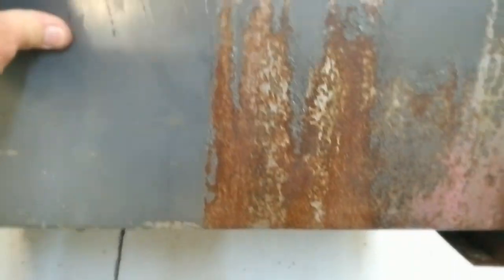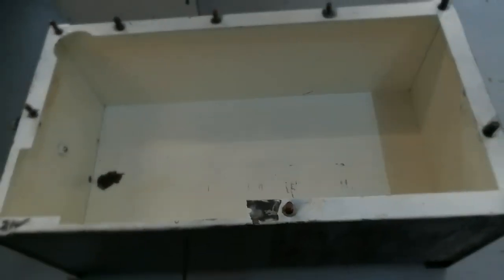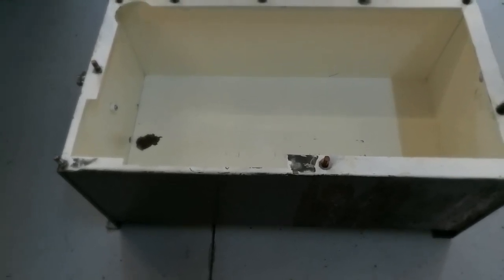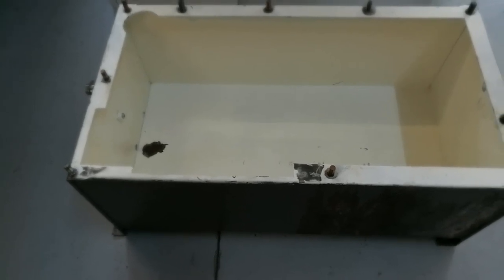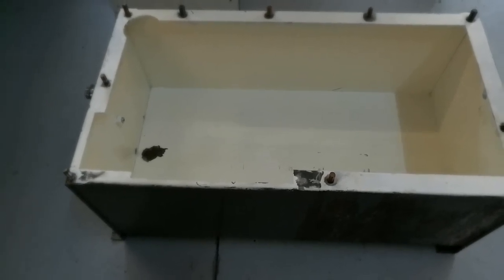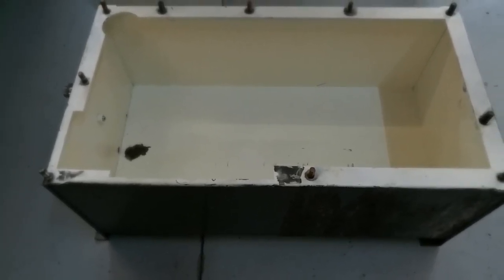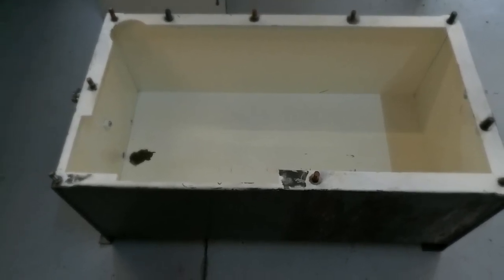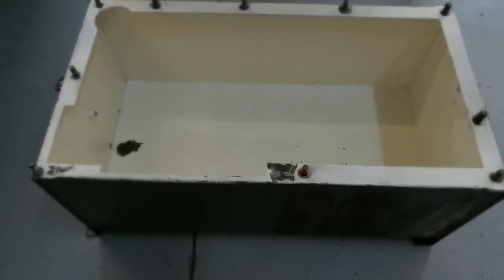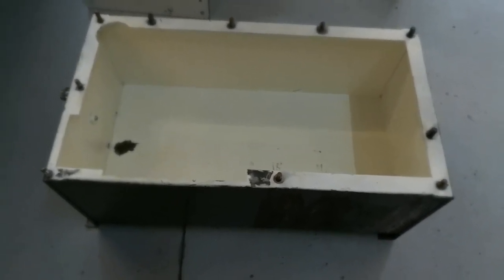Just to finish off the video, let me show you the hydraulic tank - probably the next job I've got to get into. You saw it in a previous video. I've cleaned it all up, and I'm looking at sending it out to be powder coated - sandblasted and repainted in flat black. Same thing again, just to help radiate heat away. The hydraulic oil does get hot from use, but there is an oil cooler and cooling fan mounted above it. It has a fairly reasonable size oil cooler and a fan to cool the oil on the return line.